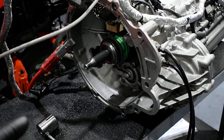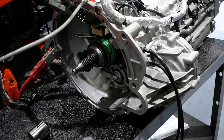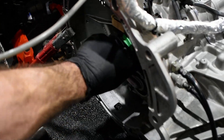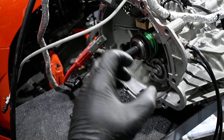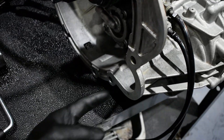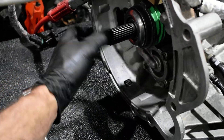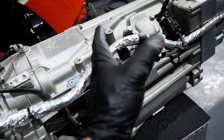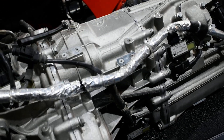It's not going to be perfect, but when we put everything together, we have to run it again. At least we can warm up the oil inside, because the new synchros are grabbing. You can stop the output shaft — for the four-wheel drive — but when you're turning it, it's very hard because the two synchro hubs are brand new. If it's a little bit close, it grabs the gear and turns at the same time.